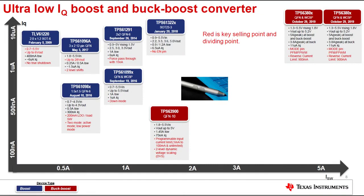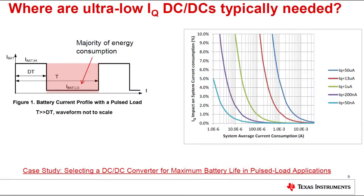Under a microamp for the quiescent current means this is an excellent chip for use with wireless devices that you only need to send data once in a while. This is what they're picking — they're saying this is really good for your LoRaWAN, really good for your BLE, even good for Wi-Fi — something that only wakes up once in a while but needs a really solid power supply at that time, and spends most of its time asleep. So why is ultra-low IQ DC needed? DC-DCs are usually not low quiescent — that's typically one of the things you give up when you move from an LDO to a DC-DC.